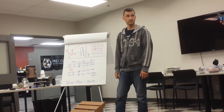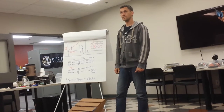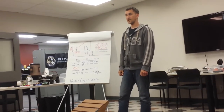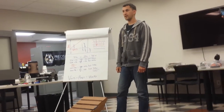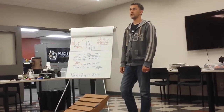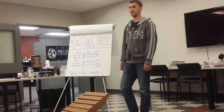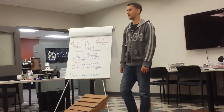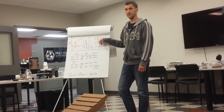Questions? I know that's a lot of food for thought, but... What's the expected life of a LiPo? Thousands of cycles. No, not the cycles, the age. I'm going to suggest that if you have three or four years of semi-regular use on a battery, it's probably time to retire it. Because after four or five years, you're starting to get enough crystallizing in the battery.